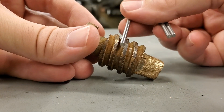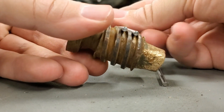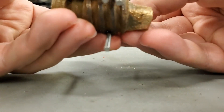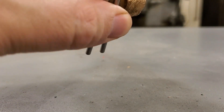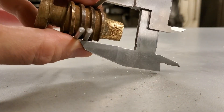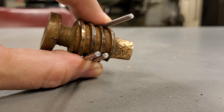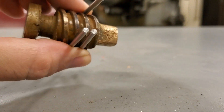Since this is a double-start stub Acme, I don't happen to have the thread specs laying around for that, so I'm going with a comparison measurement. I'm taking these two wires that just stick up over the threads and I'm going to measure the original part with that and then just recreate that measurement on the new thread. These wires are really far apart and I don't have a disc micrometer, so I'm going to have to do this with calipers. It's not the most accurate way but it's the only thing I've got. I'll measure it off camera and get everything that I need and then transfer it over to the new piece.